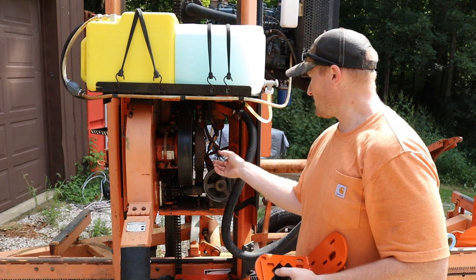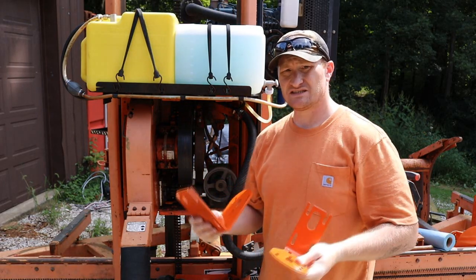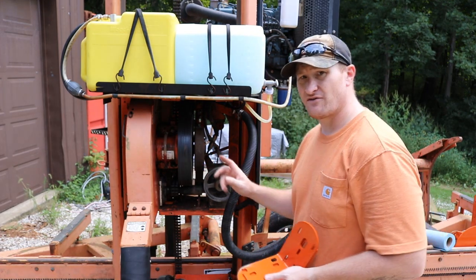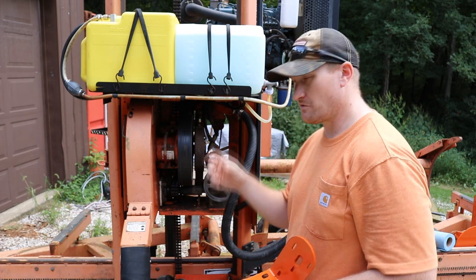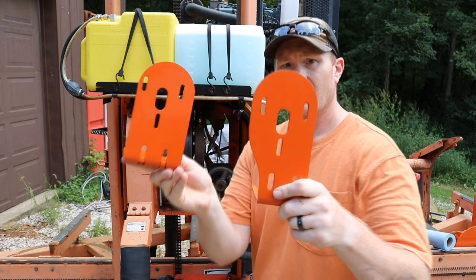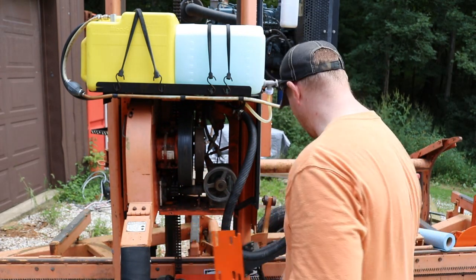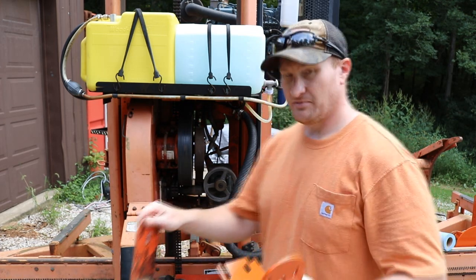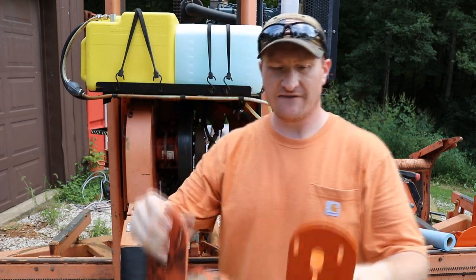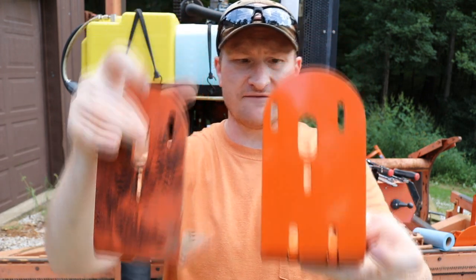Now I've got the motor removed off of the top of the gearbox housing. It comes with two new brackets because you could have two different types of gearboxes depending on the year of the machine. If you have a grove gearbox it gets one bracket, and if you have the newer one it gets a different one — mine is a grove. How do you know which bracket to use? Simply grab the old bracket and it will look just like the bracket you just had. The only difference is this one has two holes on the bottom — that's the only difference between the two brackets.